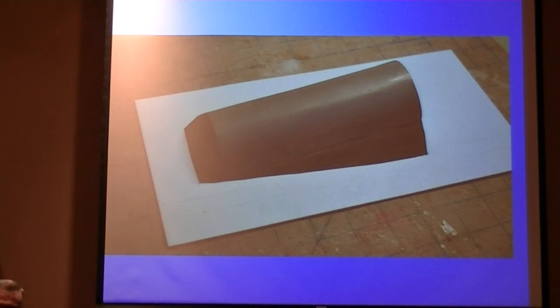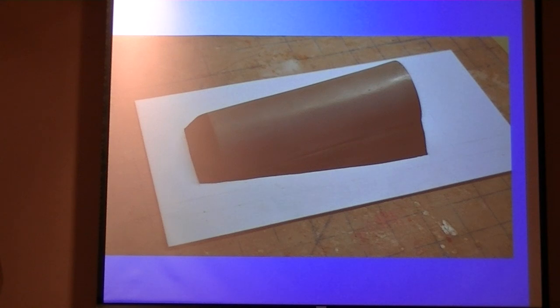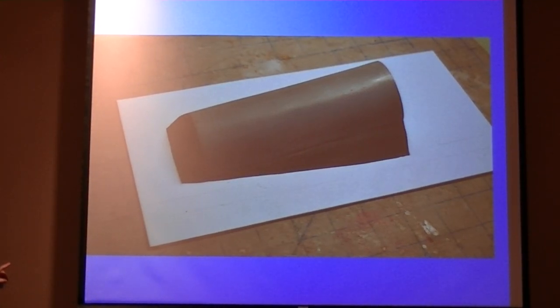After that, you have to clean it up and make it as smooth as possible, because you're going to be making the mold. Any imperfections in the actual prototype are going to show up in the mold. I painted it and sanded it. Then you've got to mount it to be able to make a mold. On a complex mold like this one, I had to think ahead — the foam wants to grow up and not sideways, so I mounted it at a little angle. I built a little pedestal using plastic and modeling clay — a special clay called clean clay that doesn't react with the rubber.